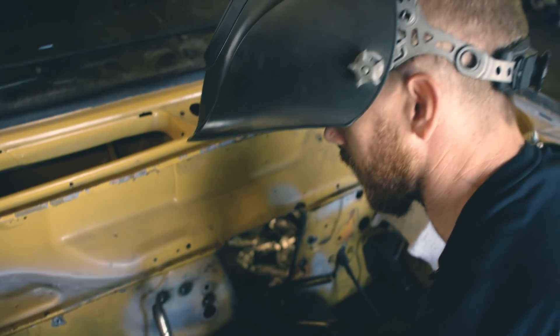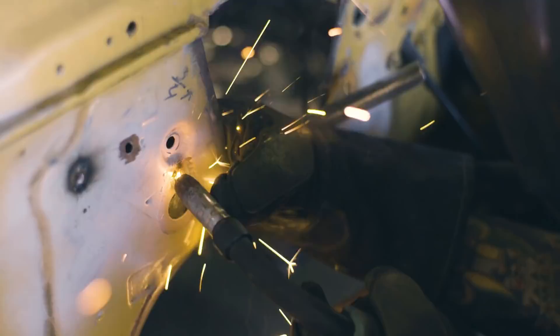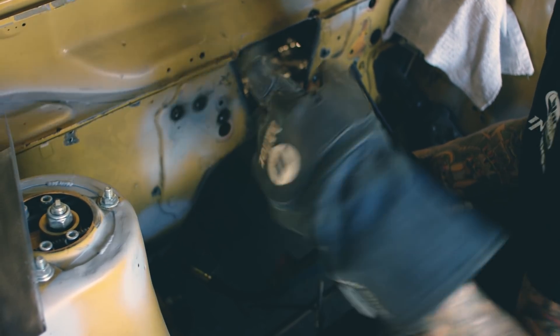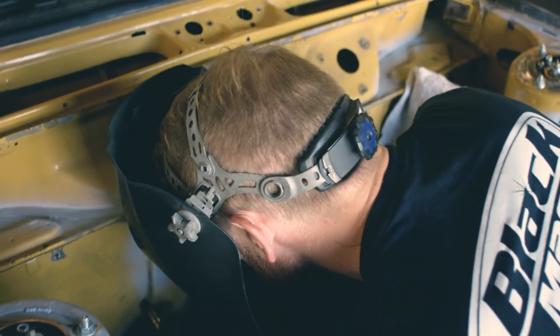Neat little trick: you grab a piece of copper so that the steel we're basically adding at the welder doesn't stick to it, so you can fill big holes. Just kind of build up the weld around it, then you take a little sander afterwards to smooth it out and plug the holes.